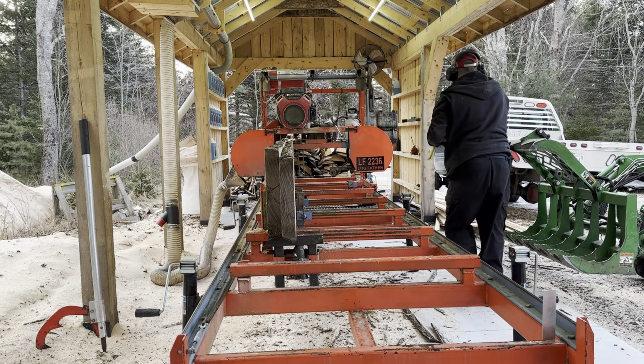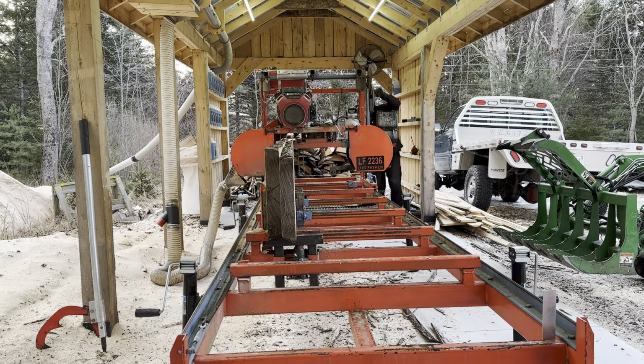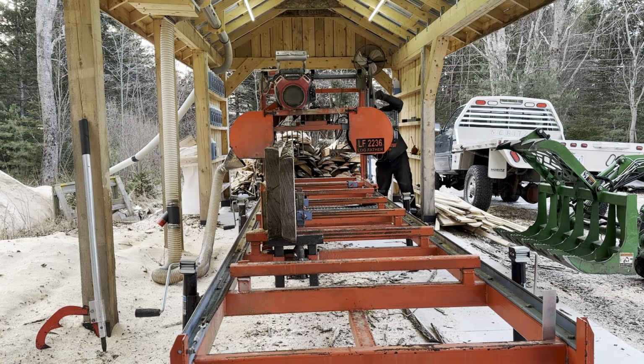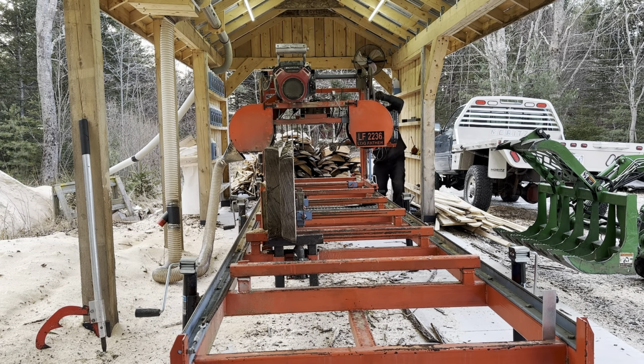So this is my 18-inch cut. I just measured to make sure that we're at the 18-inch mark, and then I'll put that sawmill head back up to the 18-inch mark. And when I say 18 inches, I'm looking at a pointer. It's a wire pointer painted red, and it's lining up to the numbers on a physical yardstick with inches along the side.